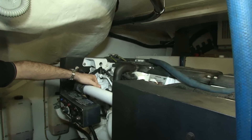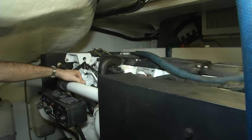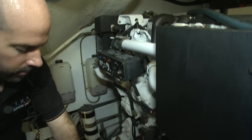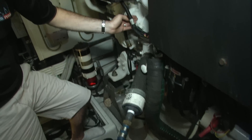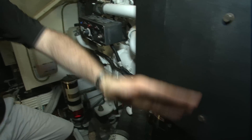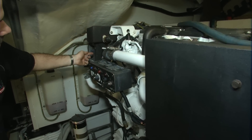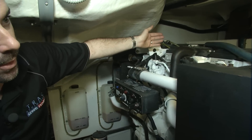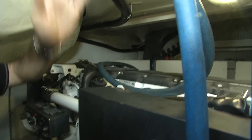Now that we're circulating our flushing unit and the barnacle buster solution, we come back down to the engine to make sure that there are no leaks and to trace the system. Here's the product coming in, going through the raw water pump, coming up then into the charge air cooler, out into the heat exchanger, across to the other side of the heat exchanger, through the fitting, and back through this hose to our flushing unit.